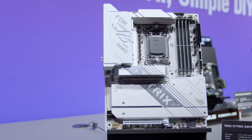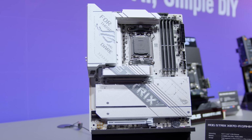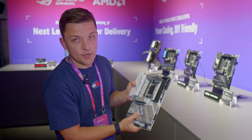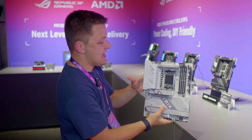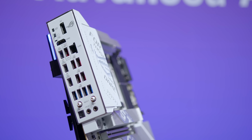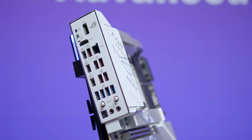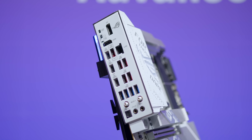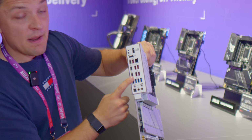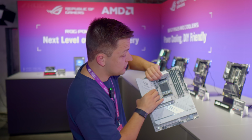They said it's actually to do with the different thermal properties of a black versus a white DIMM, and similarly it would be great to see some of these other plastic moldings move to white too. But I'm being really picky, and I actually think that the board otherwise is completely stunning. I/O on the back of this is again pretty stacked. 2.5 gig Ethernet, your 10 gig Type-As are really widespread, 5 of those, and then you've got a whopping 2 40 gigabit USBs as well as DisplayPort functionality over those as well, which is really great to see.